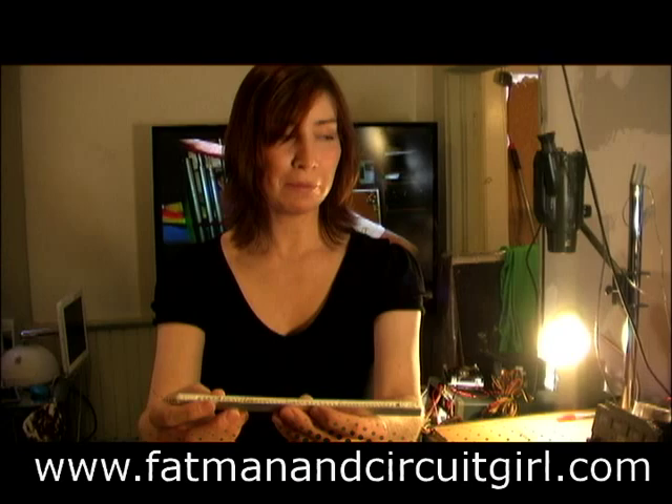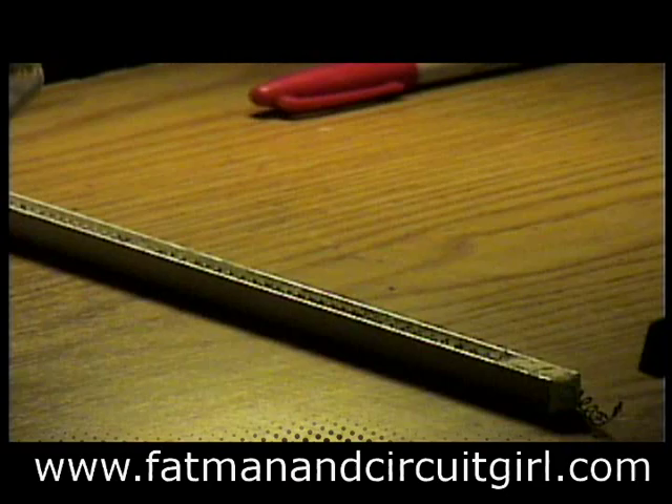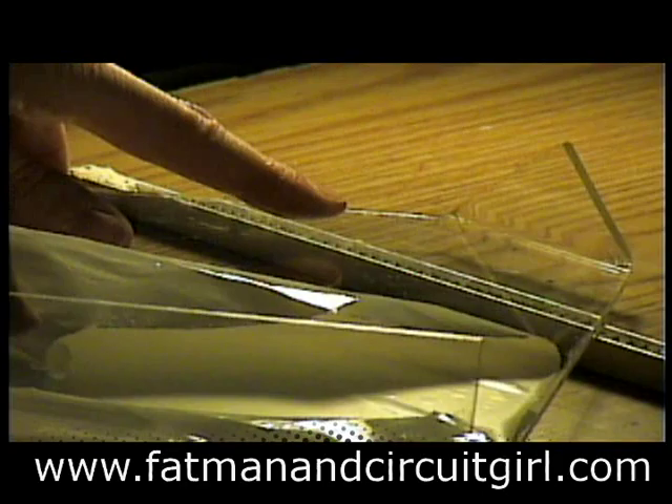Insulated from the metal — so we've just made a linear heater. As you can see, there's a huge burn mark from where I ran this earlier, so it should be on a metal table or something fairly non-flammable. You can build up spacers and have multiples of these running at the same time. Set the plexiglass down with the protective cover off — I tried it once with the cover on and it doesn't work. Lay it down and run it through your adjustable power supply.